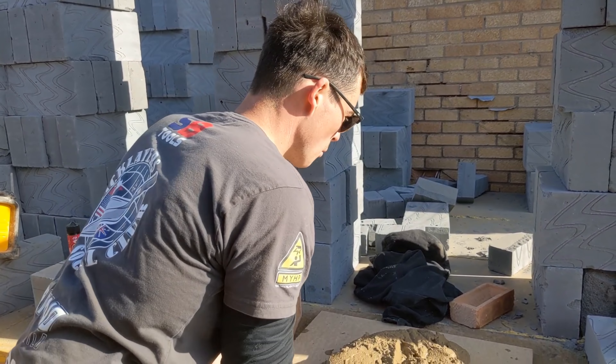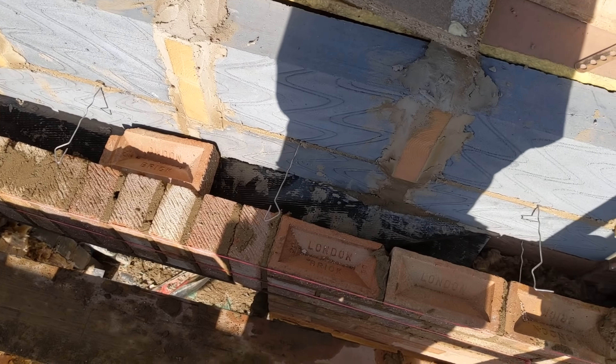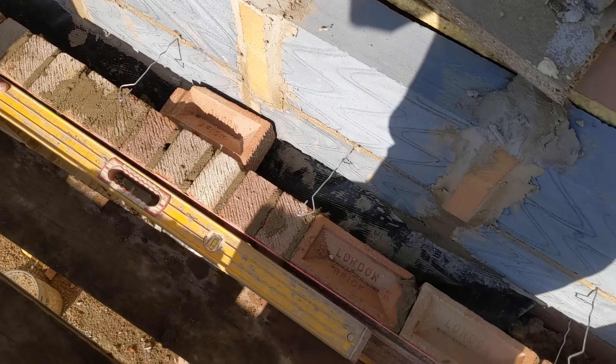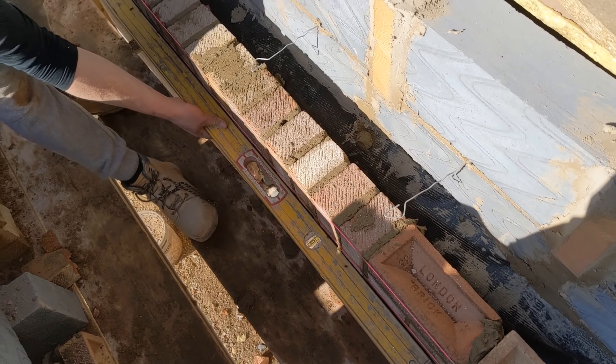So I've just put those soldiers on. What a lot of people do nowadays is they whack a profile from that pillar to that pillar and then you can just literally build it straight with a profile. However, I've done it old school with a couple of lines of course as my guide. Once you've built it, it's good to check to see how it ranges in. Here I've got a little gap so I can just give it a little wiggle. You see how that one there is touching at the bottom, whereas it's touching at the line at the top — so you just tweak it out slightly and make sure it's all perfect, otherwise you'll have a massive belly in your brickwork above. Just quite good practice to make sure everything ranges through nicely.